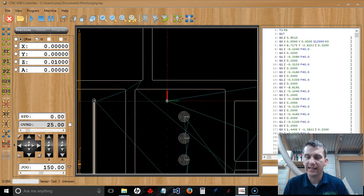So our Z is zeroed out. Those are the two methods for zeroing out your Z: the manual method, where you come down, it touches off and stops, and then you program that position; or the automatic method, using the Z offset button to automatically touch off and park itself. Once we do that, we are ready to run our job.